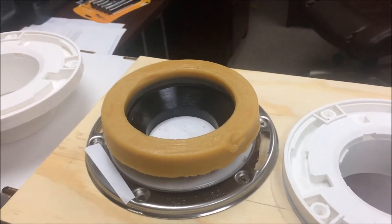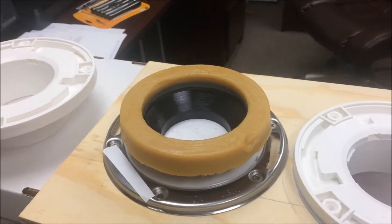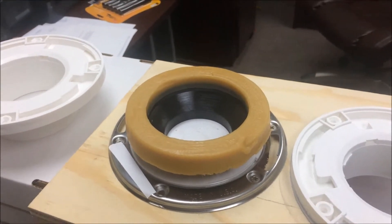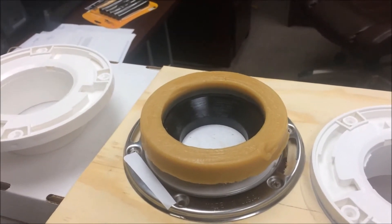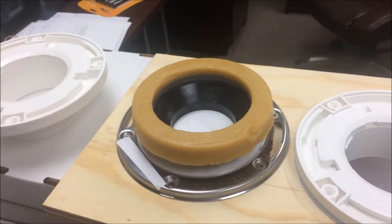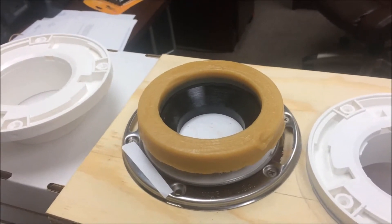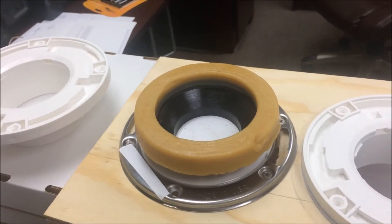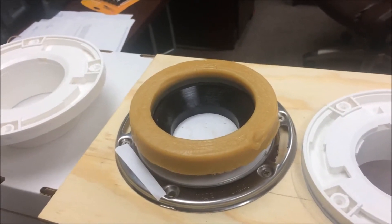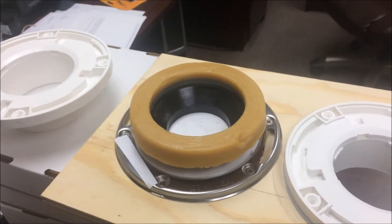And that's not the only way water can get into your subfloor through your open slot toilet flange. When the toilet is sitting on your tile floor there's not a perfect seal between the toilet and the tiles. So water can get under the toilet from mopping the floor, from water pooling, from overspray from the shower, or a mini flood. And water can get into the subfloor just through the process of water flowing underneath the toilet flange, and that moisture is what causes mold.